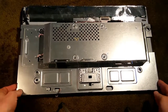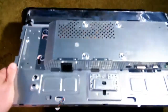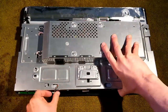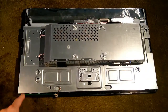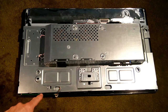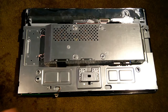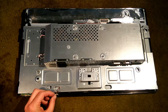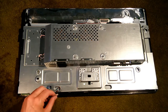That's pretty much everything on the panel and electronic side. Now remember that our button board is part of the bezel, so we're going to drop our electronics into the bezel. Even if the button board got loose, when you put the panel back in it pretty much presses it back into place, so that's not a terribly great problem. Now at this point we're going to carefully reconnect this connector. You can see how short that cable is — you really don't have a lot of room to play around. Reconnect this connector to the button board.